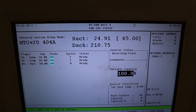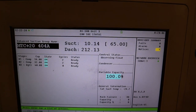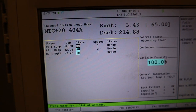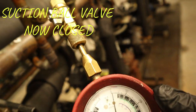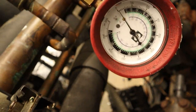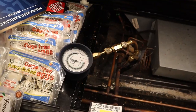25 pounds now. 10 pounds — come on, 3! Oh crap, stop — we can't stop it, it's too dangerous, we've got to slow down first. Now I've gotta turn everything back off and put it back in auto. The suction ball valve is now closed, so my liquid and my suction are both closed, and I'm down to about one pound of pressure — that's as low as I'm gonna get it.